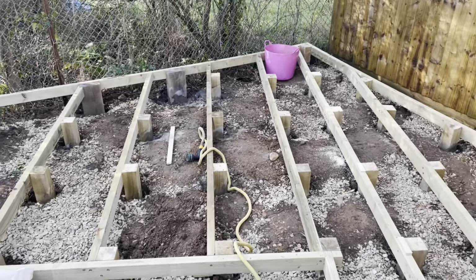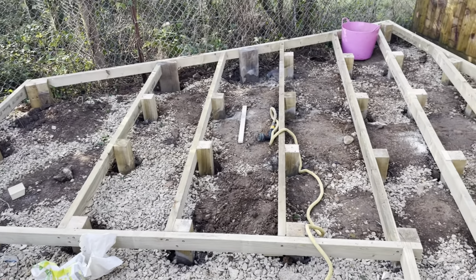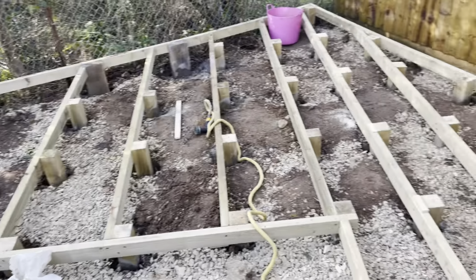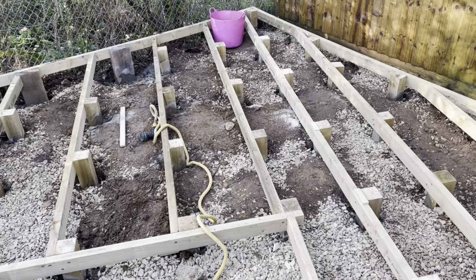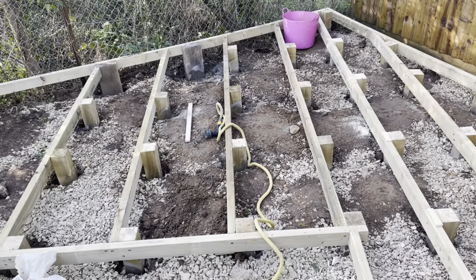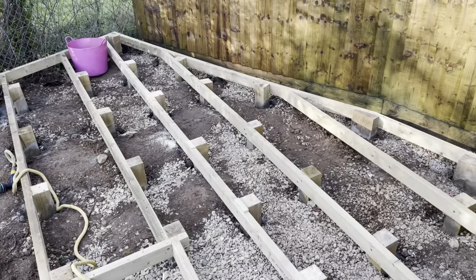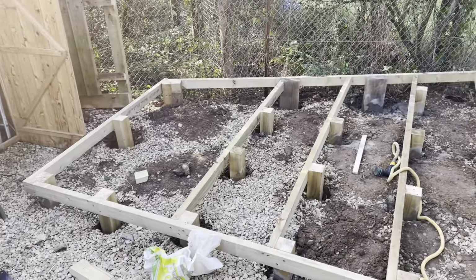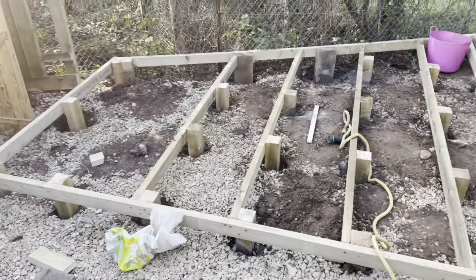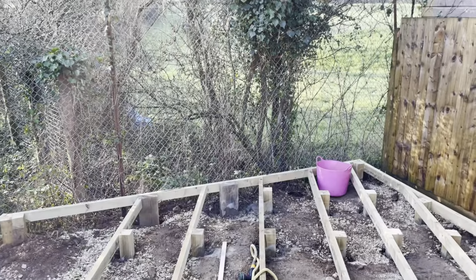And then we start laying the floor soon. We've got the Celotex, it's actually not Celotex, it's Jewson's own, but that'll be the insulation that's going in. The battening goes underneath just to support it. The insulation goes on the bottom, and you'll see that. And then we've got the breathable membrane that goes over it, and then we've got the floorboards. It's 18 mil exterior ply that we're using on the floor. So you'll see that as we go along. So that's going to be the day. And the weather is beautiful.